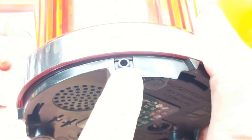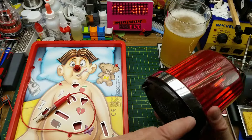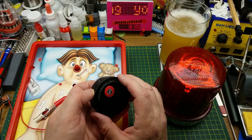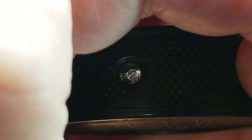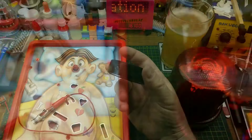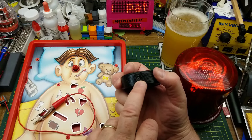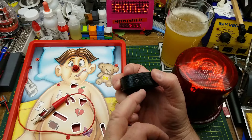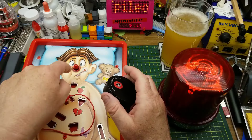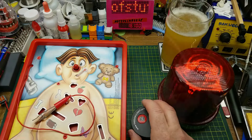The loud part isn't part of my brief because this thing does have an audio out and he has an amplified speaker he can connect to, so that's not a big deal. He simply wants it triggered - he said I can hack it up, run wires in, do whatever I want. I would like to use the remote control, and even more slick if I can pull it off is that this is an infrared remote. I'm hoping I can just interpret that using an Arduino and duplicate it using an Arduino, and interface that with this guy so I don't have to hack either unit up.